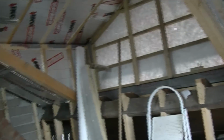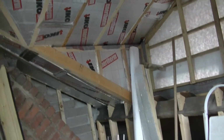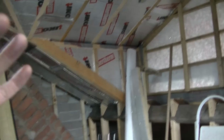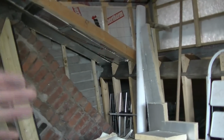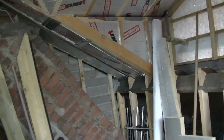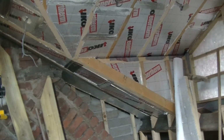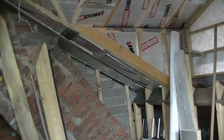Like I say, I don't really know if you need to do it on this layer of insulation because I'll be doing it on the next layer as well, but what this does is helps create your vapour barrier, which effectively means that on the inside of your room, any moisture from just the general household, your breathing, sweat, all that kind of thing, you have windows which allow it all out the window, and then above this layer of insulation you have your air gap, which you've seen and you've felt. So on the outside all that moisture should expel easily anyway, because I've got an air gap and I've got the breathable membrane.